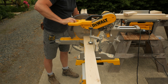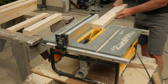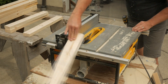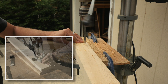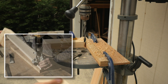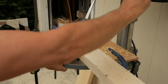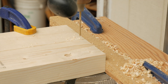The sides are made from a 2x4. Like the base, they are cut to length on the miter saw, then ripped down to width on the table saw. The sides are laid out and the hole for the dowels drilled. I use a small benchtop drill press, but you could carefully freehand this or use a drill guide. You want the pipe holder pegs to be at right angles — 90 degrees — to the sides. I like to drill pilot holes for the assembly screws at this time. It makes assembly easier later.